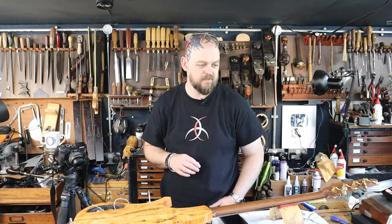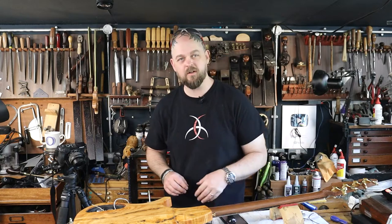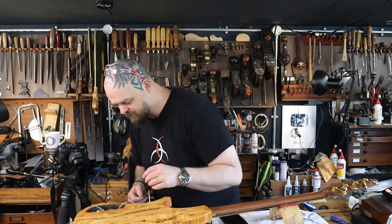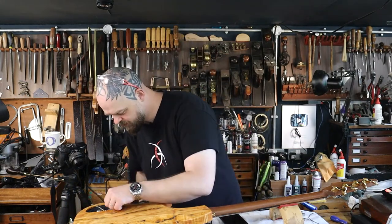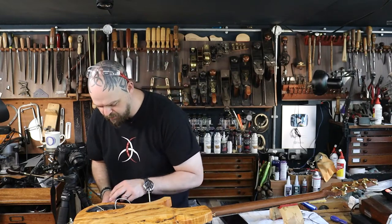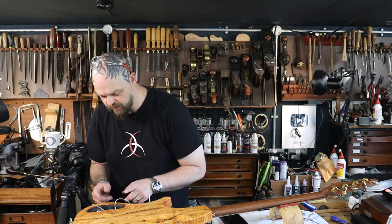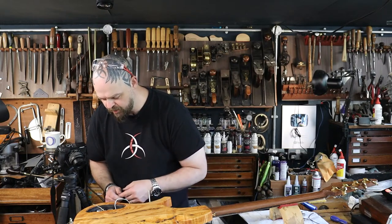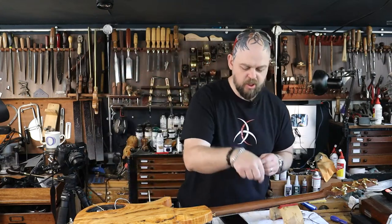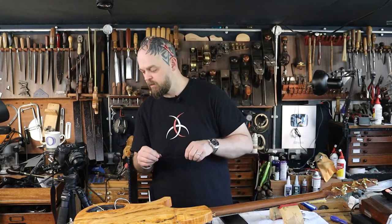Soldering tip, if this is from Tutankhamen, if you need to hold a wire steady, put the solder reel on it. That's a very cool one. Okay, so we've got ground going to the center pot from the bridge, from the Faraday cage, and from the other pots. I'm now going to go from that pot all the way out to my jack.